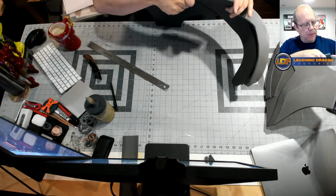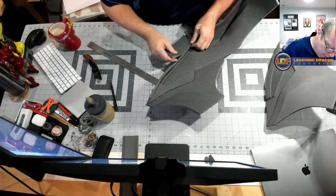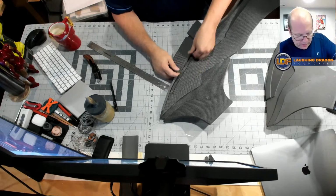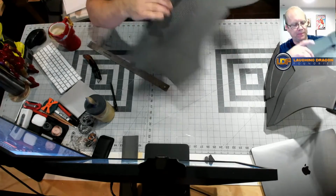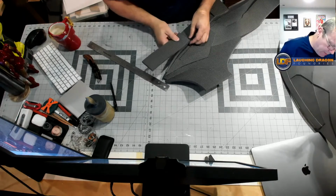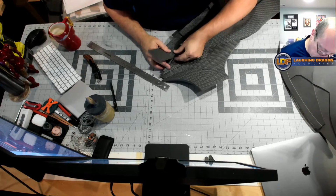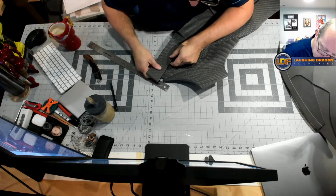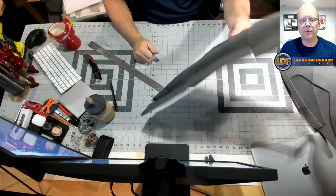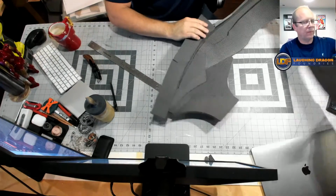Okay. What I like to do sometimes is just flip it over and line it up on the back like this. If I get it lined up back here, then I know it'll be square on the front too when I attach the other side. So there's that piece. And then we've got one more piece. There it is. That goes down the side here. Again, line it up. Now you're going to find that this curves a little bit. That's okay. Just follow the curve with your piece, and when we bring it all together, it'll straighten right out. Alright, so there's what we have for our center joiner. Okay, and you can see we got kind of a little staircase effect going on here. And we'll take our other side.